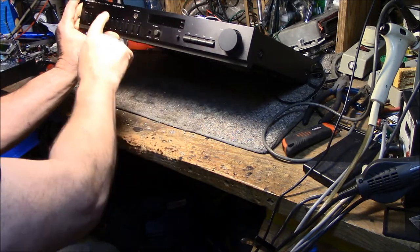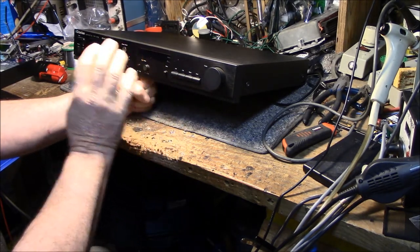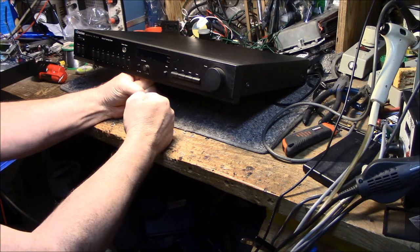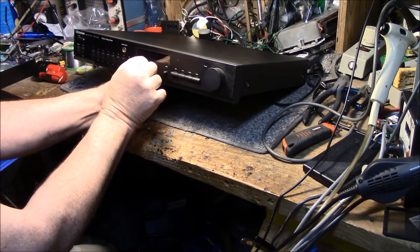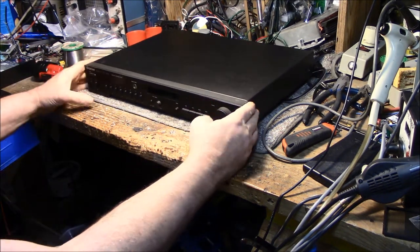I'm missing one of the outer conductors of the RCA jack, so I'll have to figure something out for that. It came with no remote and no antenna. A remote is on the way — supposed to be here tomorrow. I found one in the States so I bought it. It has 16 presets. The active tracking tuner feature uses a phase-lock loop; when a station is swamped out by an adjacent station, you can tune away from the interference.